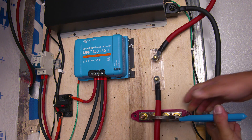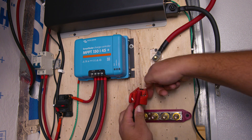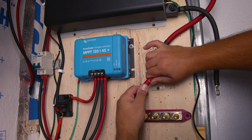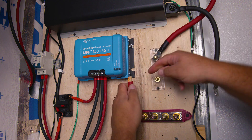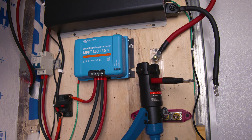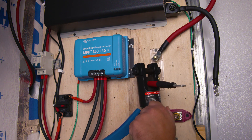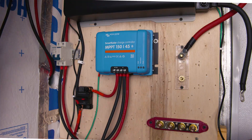Because our wire is no longer going to be connected directly to the switch, we're going to have to make a small wire to go between the fuse and the bus bar. To cut the wire we're going to use a heavy-duty cable cutter, which can also be used to strip wire. For stripping big wire, what we like to use is this cable stripper from iCrimp — it can handle from 12 gauge all the way to 4/0 gauge. To crimp our lug on our wire we're using a 12-ton hydraulic crimping tool that can go from 8 gauge all the way up to 4/0 gauge.